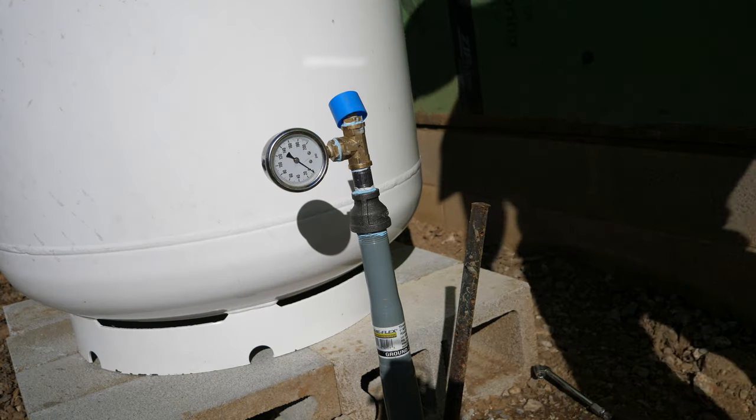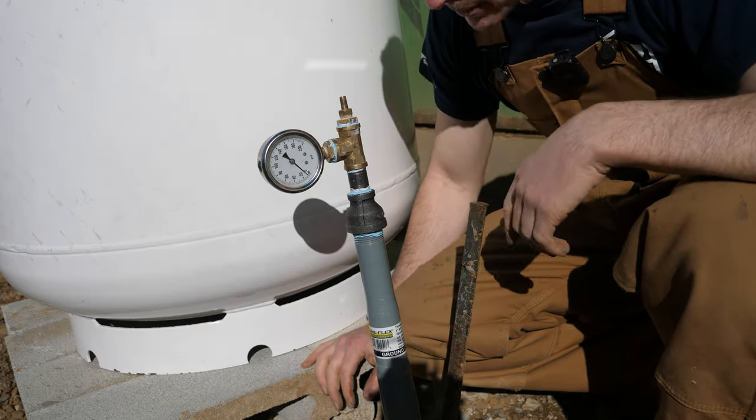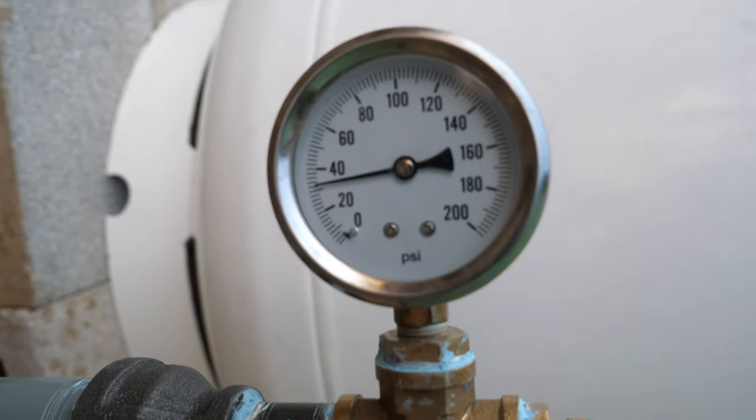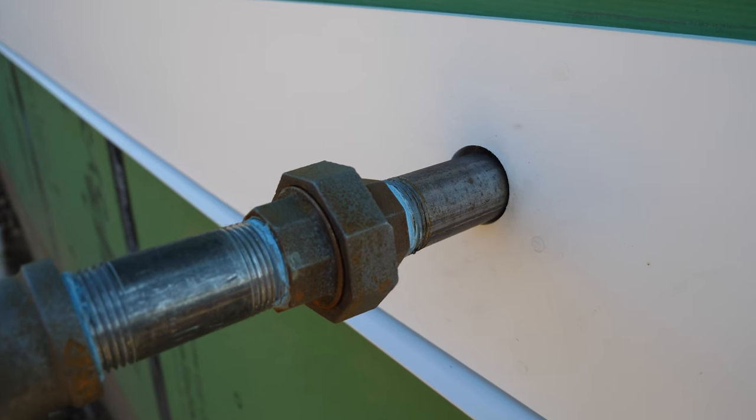The moment of truth. I'm just going to go to 10 psi — the actual system runs at about half a psi so it really doesn't need much. I went up to 20 and within half an hour it was down to about 18, so I knew there was a small leak somewhere. Then I went up to 40 and an hour later it was down to 30. I definitely have a leak. I have a suspicion it's at the big union right in front of the house — I never have luck getting those unions to seal. So that's suspect number one.